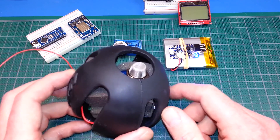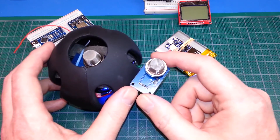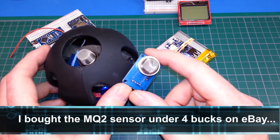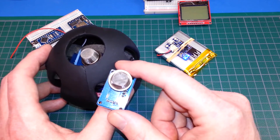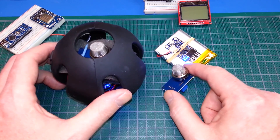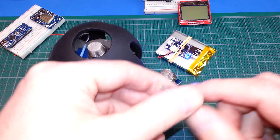This is a quick overview of my smoke gas detector hand grenade of sorts that I made. I took the MQ2 LPG liquefied petroleum gas sensor as well as CO carbon monoxide and smoke, and integrated it with an Arduino Nano. I added the PowerBoost 500 from Adafruit with a LiPo battery and a 433 megahertz transmitter.